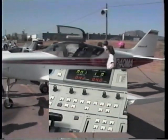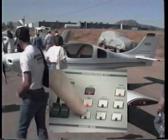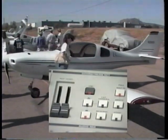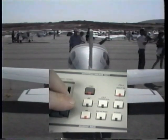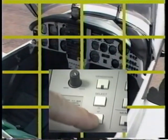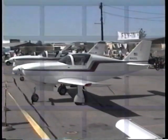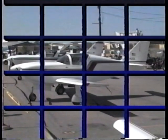Now go back to the A bus and feed it a video signal while turning the downstream key section on and selecting the B bus as its input. Slowly bring up the right fader control until the outline of the B bus starts showing through. You can change the color of the outline with the background color selector. And for the best effect, push the edge button 4 times to add some drop shadow depth to the picture. This effect can be faded in and out of by way of the DSK fader.